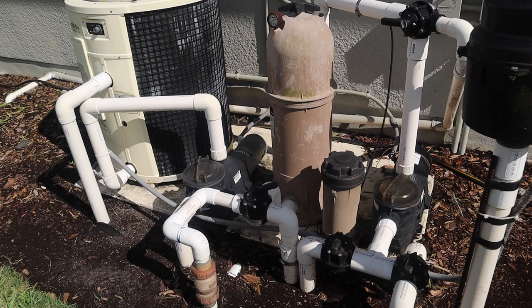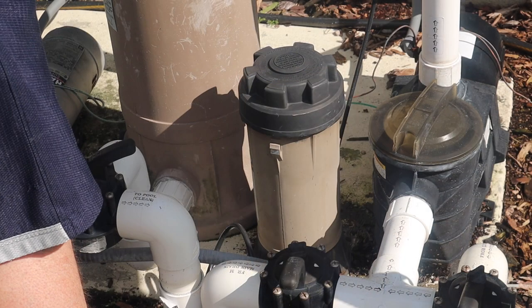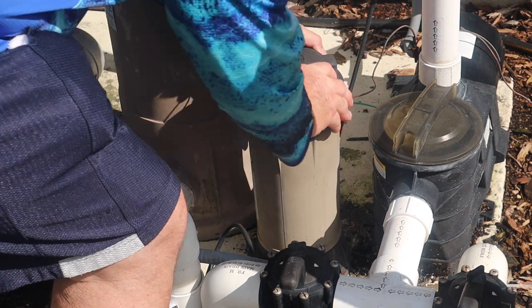There's a canister inside that large container that you need to pull out and clean weekly after you brush the pool — it collects all the dirt in the water. You'll also do that after you use the Stop Yellow. If your pool was in trouble, you've brushed it, let it sit overnight, and now there's dead algae in that canister — you need to get it out so it doesn't go back in the pool. At the top of the canister there is a handle that you spin — there's a big screw that goes down through the middle. You turn the pool pump off in order to open this canister because it's under pressure and water would just come flowing out.